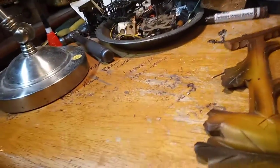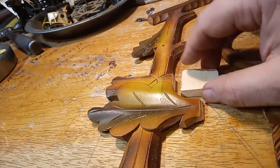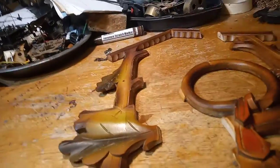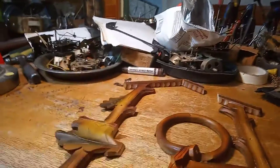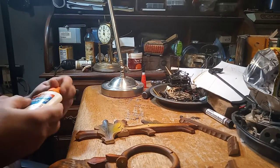Continuing on with this clock, the trim has to be fixed. I got a piece of wood that I'm gonna put right here and glue it. But prior to that, I need to connect these pieces — just like with the deer ear, I got a nail put in here and ground off the sharp ends on both sides. That way when I add glue, that nail is gonna hold this piece together as it dries, and with the nail in both sides you can kind of tweak the boards to get it to dry and hold properly.